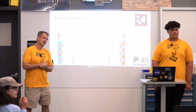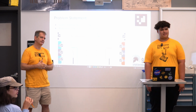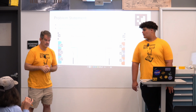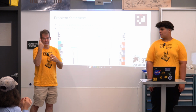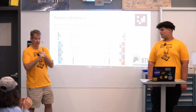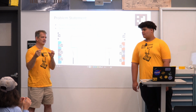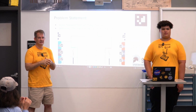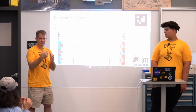You're using a Raspberry Pi. We're using a Rock Pi, but yeah, very similar. I guess you're avoiding using a USB camera. We are, using a fast interface. Yes, absolutely, that's a great point. So just so I can repeat it: we're using a Rock Pi, and we are definitely avoiding USB interfaces, primarily because we've had challenges with flaky connections trying to get USB to be solid, but also the speed you get with MIPI transfer is faster. So there are advantages there.